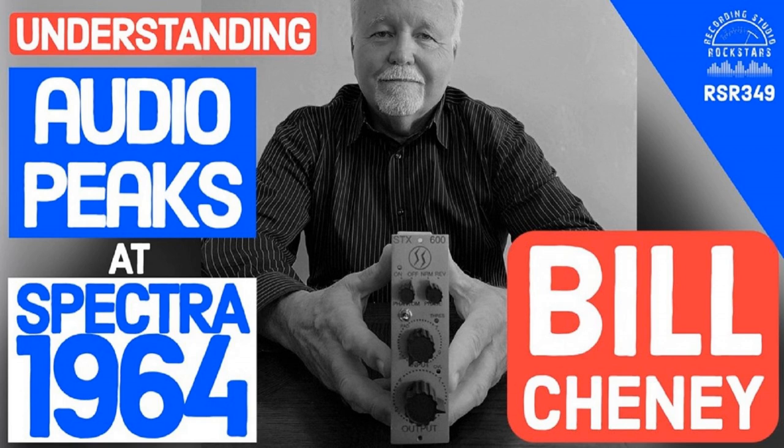When people hear the 101 compared to the 110, some conventional artists prefer the sound of the 101 — there's a slight difference. It's basically because of the power supply rails. They're essentially the same circuit except for one bipolar part. The front end is all the same between the 101 and 110. In use-case terms: the 110 circuit is in the STX 100, and the 101 circuit is in the 100D.